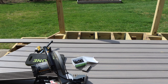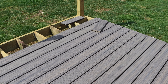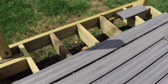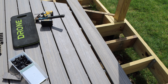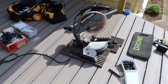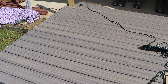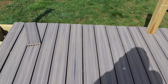We're cutting everything with the miter saw to the correct sizes. I'm going to make all our cuts and get our new pieces of decking down. Once the decking is down, we'll proceed to putting up the sleeve covers over the posts and cutting the posts to the correct length — that cuts very easily with a chop saw. That's what it looks like right now with the new decking down and all the hidden fasteners in place. Let's finish this deck up and go on to the next step.